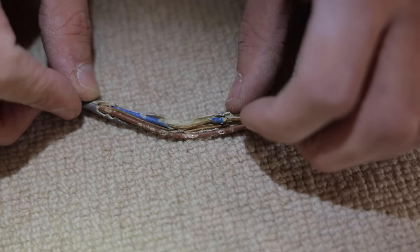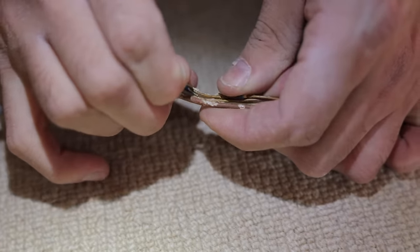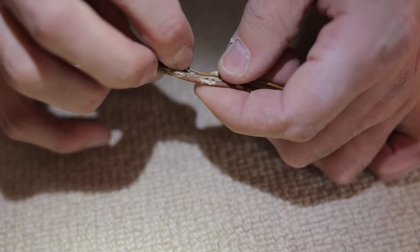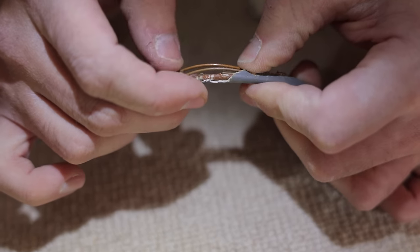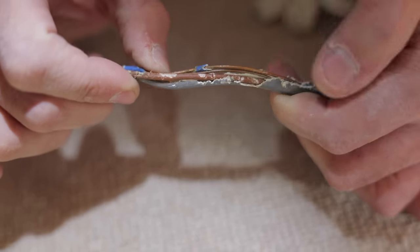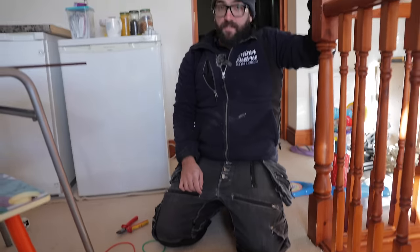So I was getting about 20 megohms when it was in the ceiling. Now, these would have been straight, but it was actually covered in Celotex. You see it around here? So I'm wondering, they would have been quite close if it was tracking across the Celotex. I'm really flabbergasted that it didn't actually cause a dead short up there, because this cable was testing out fine. On an EICR, that would have been a passable reading.